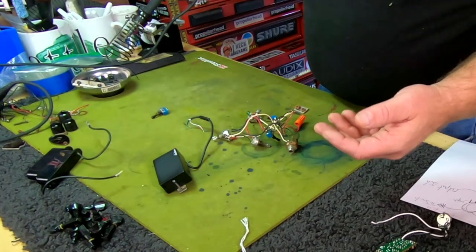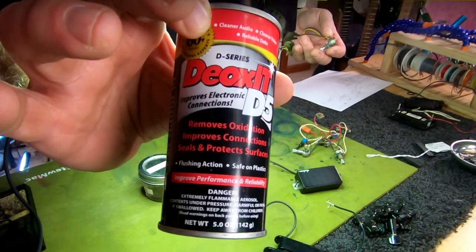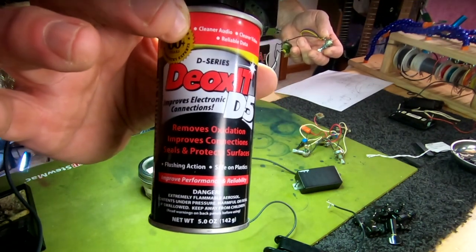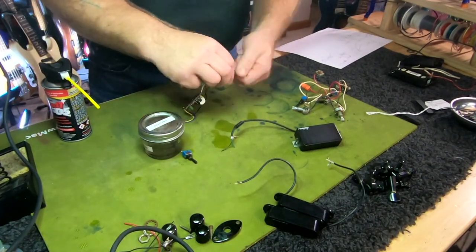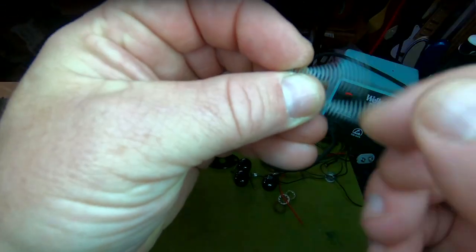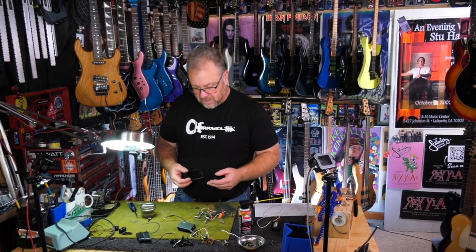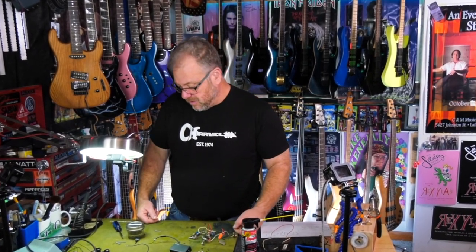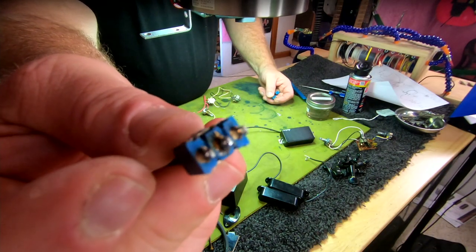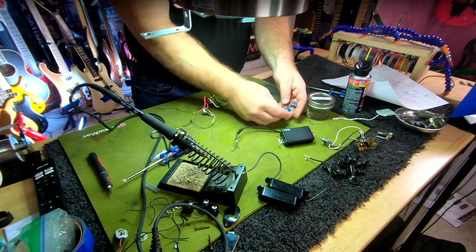There's also a lot of filth going on here, so let's just get to it and start cleaning. For anybody that doesn't know, if you've got a scratchy pot or a funky switch, a little squirt of DeoxIT will usually take care of it. You can also use the electrical contact cleaner that you get at Lowe's or Home Depot. There's an awful lot of oxidization on a lot of these parts. These springs are just powdery and gross. I got all three switches all nice and cleaned up, and let's get a little DeoxIT in there to make sure they're working just dandy.